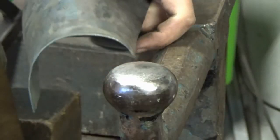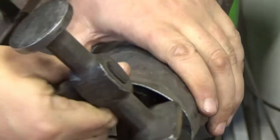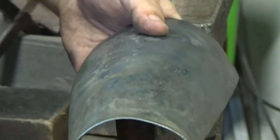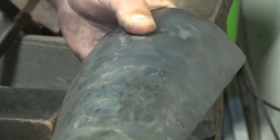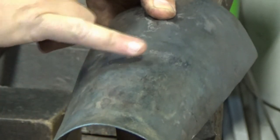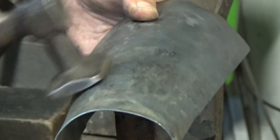I'm going to take a quick look at how to work on the outside of the material over the stake. You have to be very careful not to hit too hard and to use the wrong stake. This one's quite flat — it needs to be riding on there, not supported by the two outside edges, otherwise you will flatten the material. But planishing from the outside is where most of the work starts, to be honest. It's quite straightforward — you just work gently in a series of strikes that smooth the surface down.